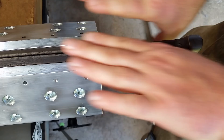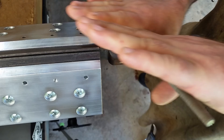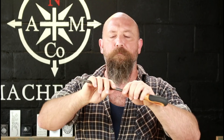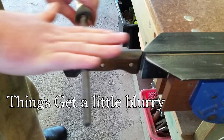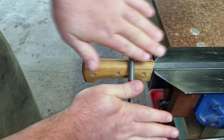The amount of pressure you use is not super hard — you're just trying to slowly work the grit of the file into the timber surface. When rolling up and back around the front and back of the handle, go nice and slow because it's very easy for the file to slip and dig a section out. You start on the low side of where you want to texture, roll backwards and forwards, and once you get a pattern you like, slightly increase the angle and keep working the file all the way around until you reach the other side where you want to stop.